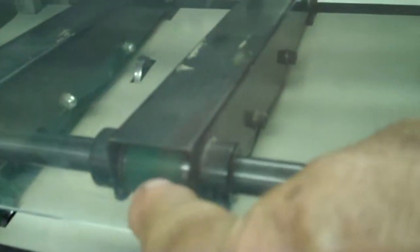Now when it goes into the trimmer, you have a similar dilemma. Now we didn't modify the trimmer in this instance here because it's a little bit more involved, but you would have to move the entry guides to the center. Again, you take the pulleys, loosen the set screws that drive the pulleys, and move the pulleys closer to the center, and then loosen this screw right inside here on this pulley, and you can actually move your two transport rollers closer in. Now you have the exit issue.